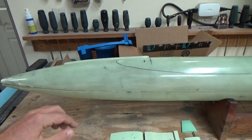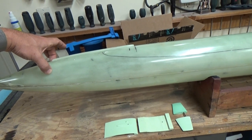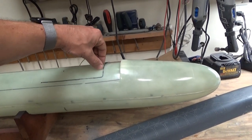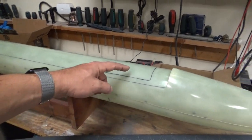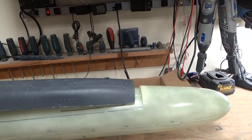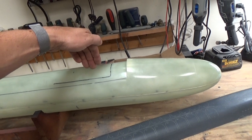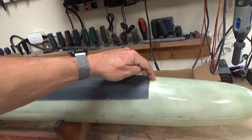That'll give us full access to the rear control linkages. This will basically be an open area in the back with the control rods running through it. Going forward, I'll probably make a cut right about here — this section will be removable, which gives us access to the sail linkages. The Ohio utilizes sailplanes in the conning tower, so we'll need access to the linkages for that. The sail will likely be mounted permanently onto the missile deck.